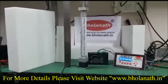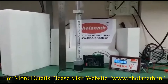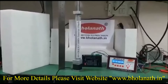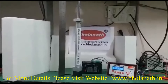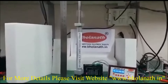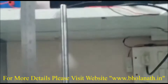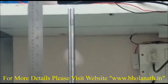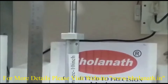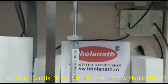Hello friends, this is Bhulanath Inline Electrical Rod Style Linear Actuator. Model number BH-ERSLA-I-1600N-5mm per second. Stroke length is 10-inch, which has force of 1600N, horizontal load push and pull capacity 10 kg, feed speed 5mm per second, positional accuracy 0.05mm.